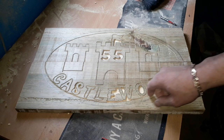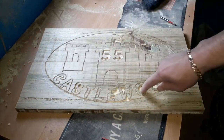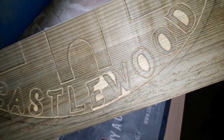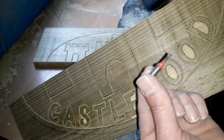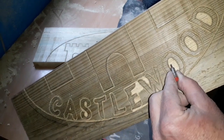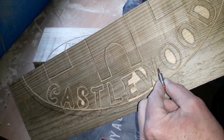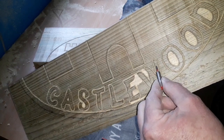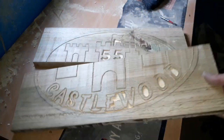You can see from that we've gone all the way around with our little CNC bit and removed some sections in between, just so I have a rough idea. This also is what I call a mid-depth gauge, so when I put on my quarter by one-eighth straight bit, I'll set it to the same depth. When we go in between these gaps and come up to the bits we've cut with the CNC, they'll pop out nicely — hopefully — without breaking any of the delicate lettering.